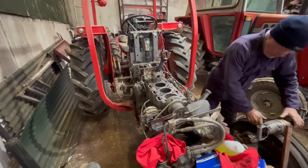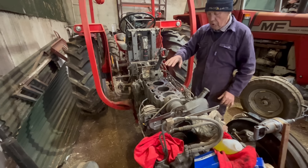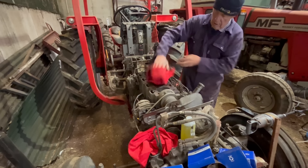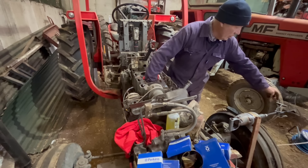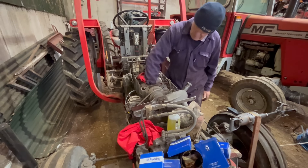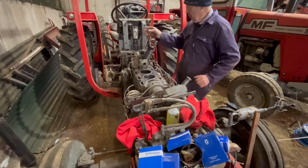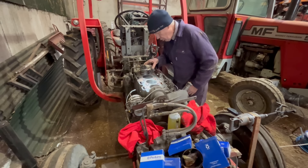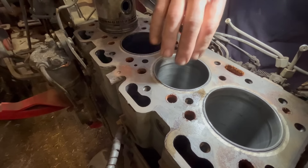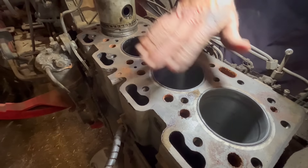Before you do any of that, you turn your crankshaft so that it's horizontal - otherwise you could rip the end of the seals on the end of the crankshaft. Now compared to this one, if you look in there you can see what that one's like, and then look in this one - much, much cleaner. It leaves it smooth enough but rough enough for the rings to bed back in again. All four of them have to be like that before we continue on.